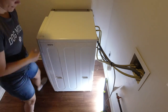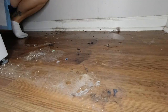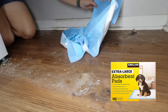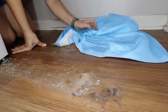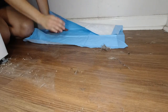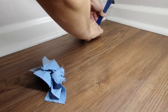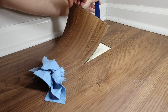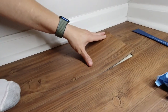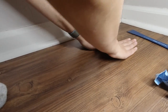The washer was still heavy, but we were able to move it, and this is what we found. Whenever we have excess water, we use puppy pads to clean them up — they work great to absorb water and can be thrown away after. We cleaned up all the water and vacuumed out the dust below. I noticed some vinyl tiles had water under them; since they were installed over sheet vinyl, the water was just sitting on top. I picked up a couple tiles to dry them out and put them back once dry.